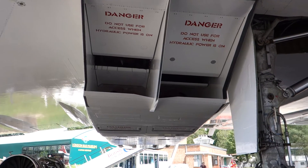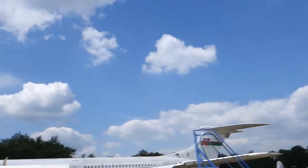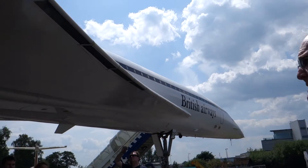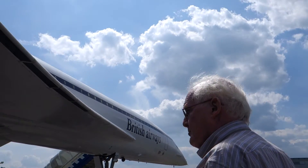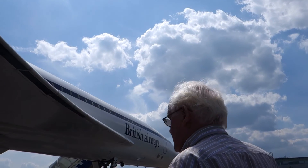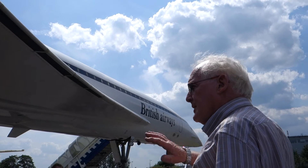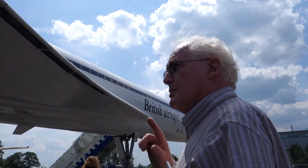When we are actually landing at 13 degrees, the nose goes down to 12 degrees, or is selected to 12 degrees. And likewise on the ground it goes down, or is selected to 5 degrees. So taxiing and take-off: 5 degrees. Landing: 12 degrees.